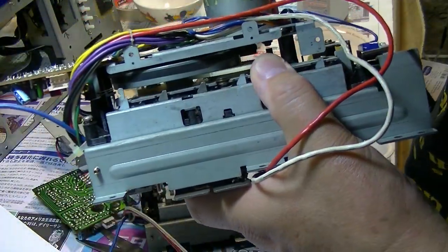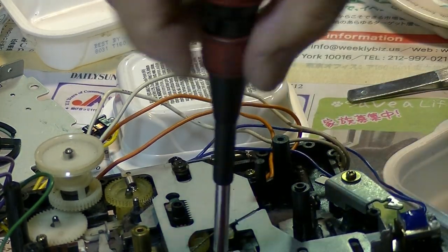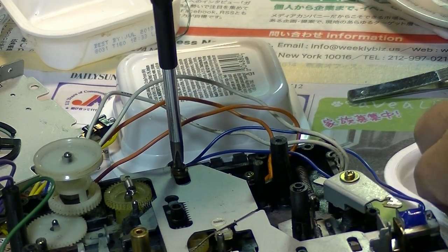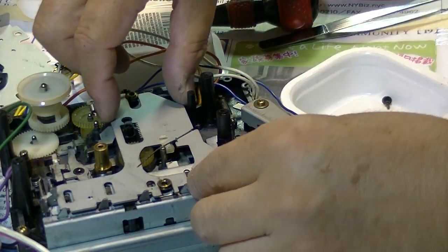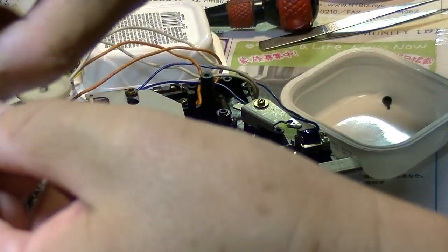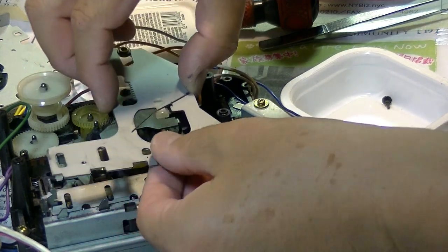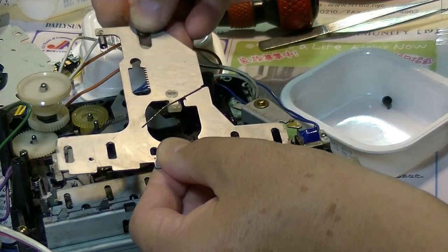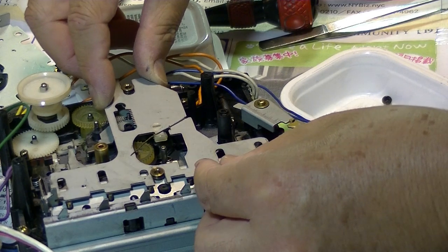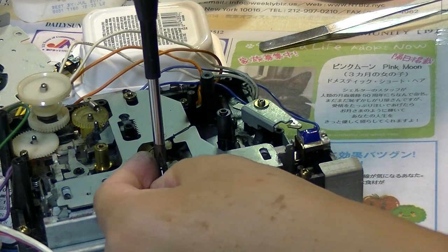Now the reason was here, the golden washer. Okay, I put this one upside down. This washer needs to make space between this steel and the underside of this steel. Checking this washer, this one is correct. This one is positioned correctly, but this one was wrong. So this washer is upside down, so I have to put it back. Yep, and send it back again here. Okay, you make a little more space than before on the top side.